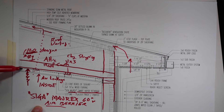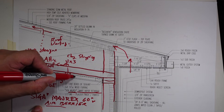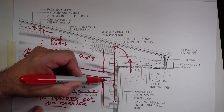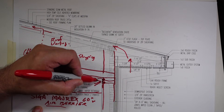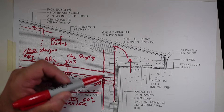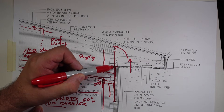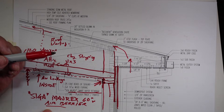So we have our strapping in there. Our Myrex is this dashed line — we put it over the strapping, and it turned down the corner here. You can see we have two beads of sealant that we bedded that in, and then basically pushed that up against there and sealed it to our plate. We have two inches of closed cell here that are helping seal it, plus we have our primary air barrier of ZIP-R9 that rides behind that.